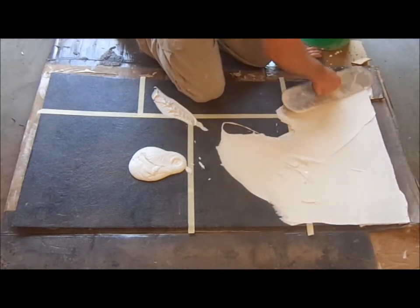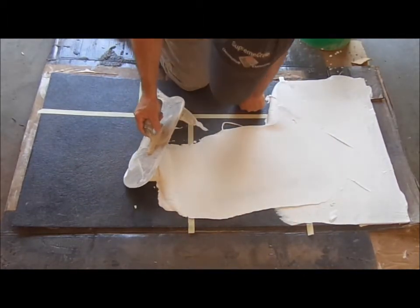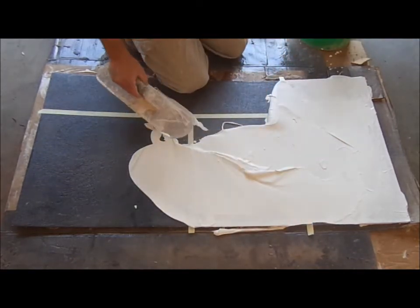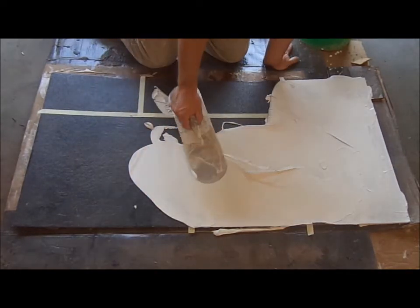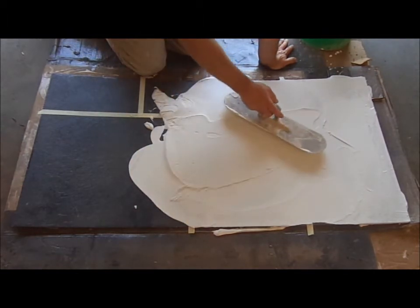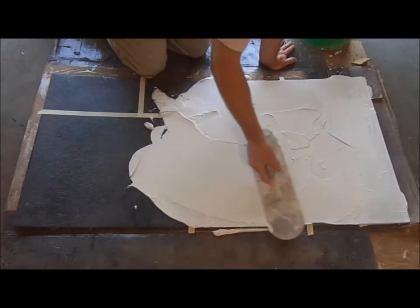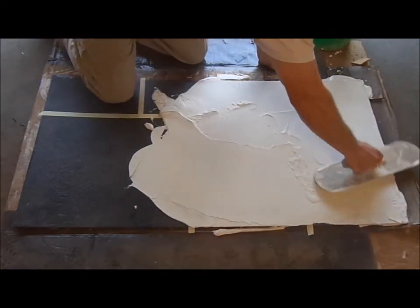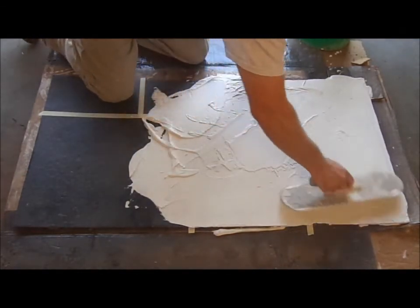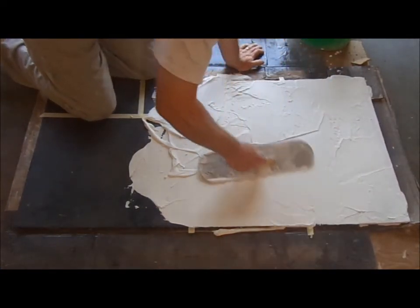You can pull it tight. You'll actually get about 175 square feet per bag doing this method. I typically like to mix up seven quarts of mixed resin per bag of texture. The texture I do here is basically short little random strokes in random directions. I've got my coverage, and then it's just the short strokes.